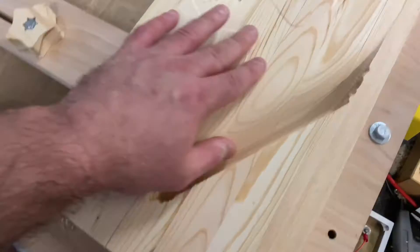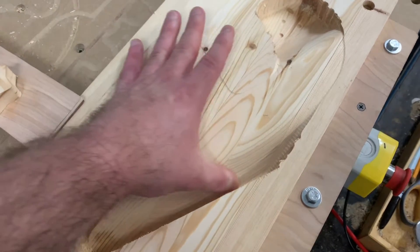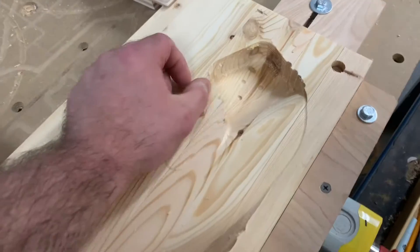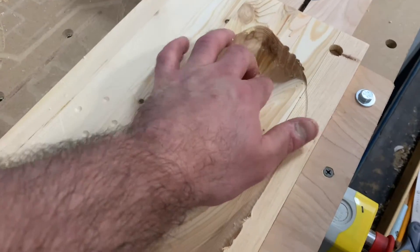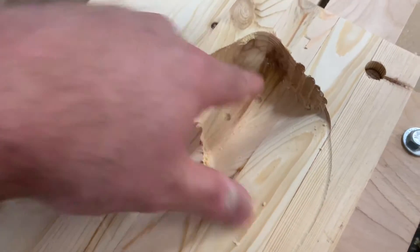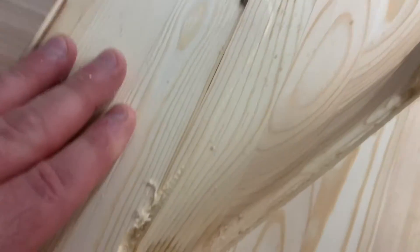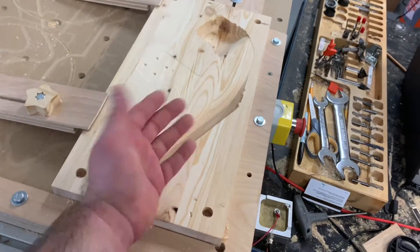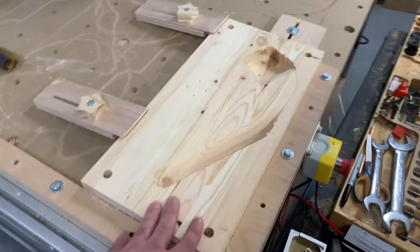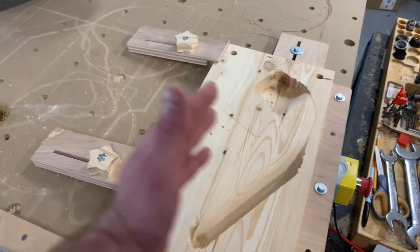So this is the finished top of the part. The surface finish is really, really good — it's super smooth. I'm probably going to need to do just a little bit of light sanding, but not much. The toolpath resolution for the ball mill is very, very small so the passes are really close together. It roughed out these holes here for fasteners — there's one right here on this little bracket — and this ramp goes all the way down to the edge. These are symmetric, so I can take this part off, turn it over and pick up the same dowel hole locations, giving me the same setup. That way I won't have any X or Y mismatch — the part's really located properly.